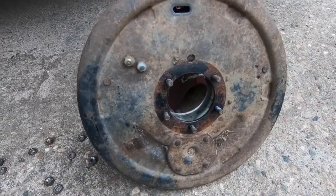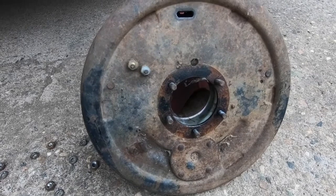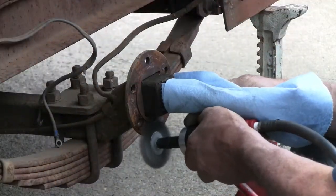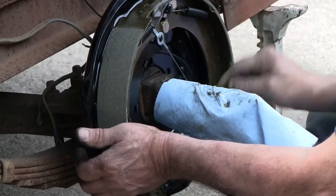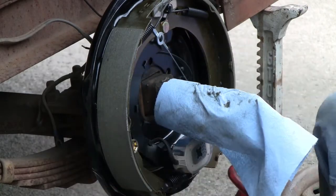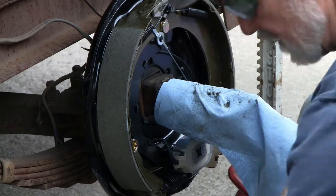These studs are spot welded into the backing plates, so I'll have to use bolts for my assembly. The bolts on the bottom have a wide spacing, so it goes like that. Again, left hand on the left side of the trailer.